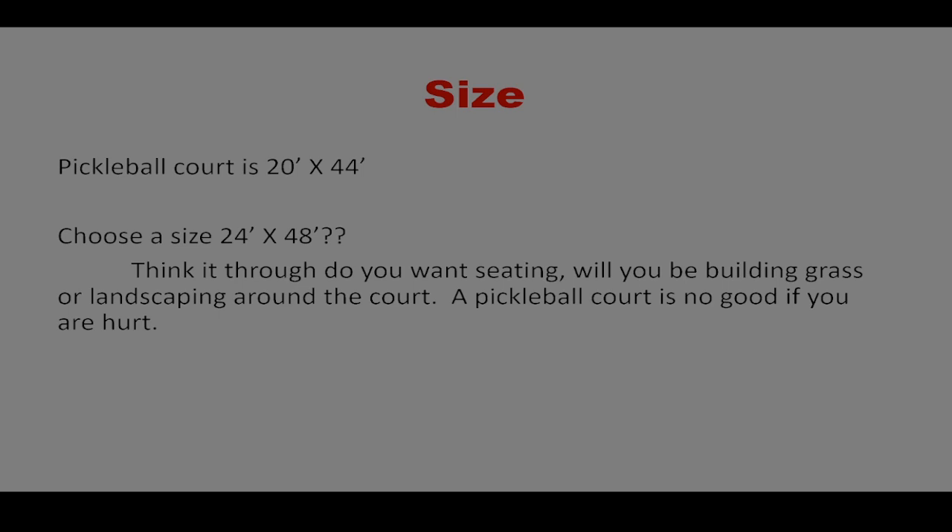That 24 by 48 size gives you a two-foot perimeter around the outside — the smallest you'd want for serving and not breaking your ankle off the edge. Preferably it would be even larger, but that's what I used for my pricing. Think it through: you might want it wider to fit a bench, or make sure two feet is enough room to stand in the back and serve. If you do go smaller, you'll want to build up the black dirt and grass seed — or put some decorative rock — to the same height as the final asphalt to prevent injuries.